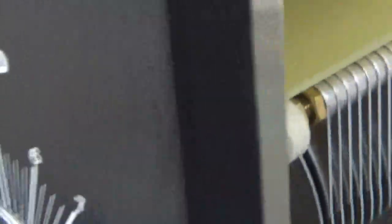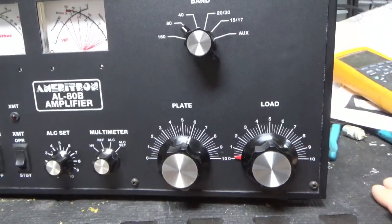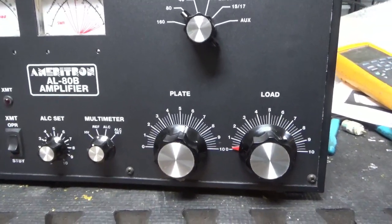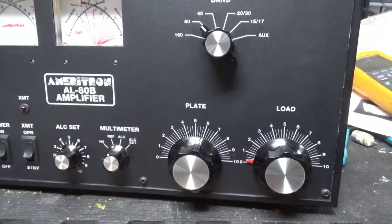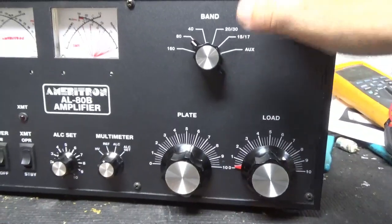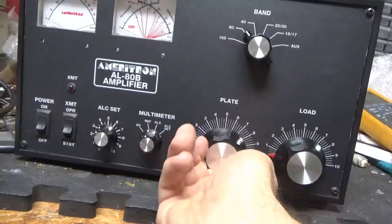The plate is badly damaged — curled over pretty good. The customer said, can you file it? The problem is I'd have to take the capacitor out to file it, and if I put it back in and it continues to arc, I have to do it all over again. I'm going into a 50 ohm load here, so it might not arc in the shop — then they get it back without a perfect 50 ohm load and have problems. I'd rather be safe than sorry. Also, the pointer is rubbing against the front panel and the knob is loose, so I'll fix that too.